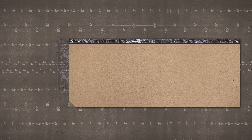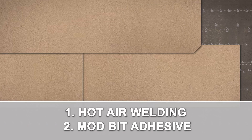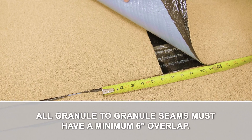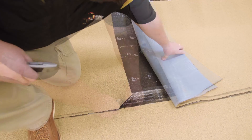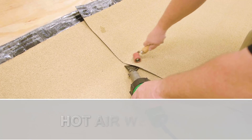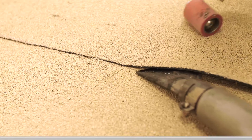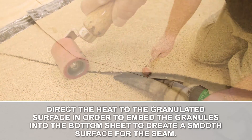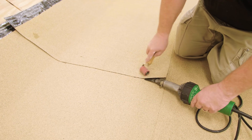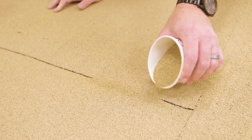When a Fast Lap End Lap or Seal Lap Side Lap is not available, granule-to-granule seaming can be done two ways: hot air welding or modbit adhesive. All granule-to-granule seams must be a minimum of 6 inches wide. At end laps, trim the upper corner at a 45-degree angle. Using a hot air welder with a wide tip and a 2-inch silicone roller, weld the entire 6-inch wide seam. Direct the heat to the granulated surface to embed the granules into the bottom sheet to create a smooth surface for the seam. When rolling, pay special attention to the angled step-off. Be careful not to overheat the material. Loose granules can be spread into the bleed-out to mask the edge of the seam.